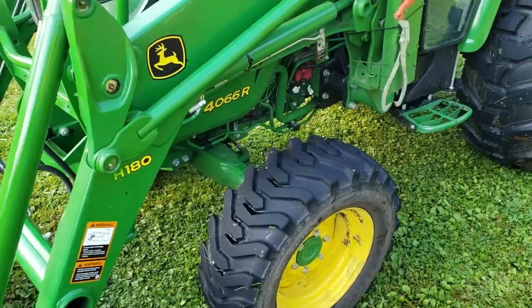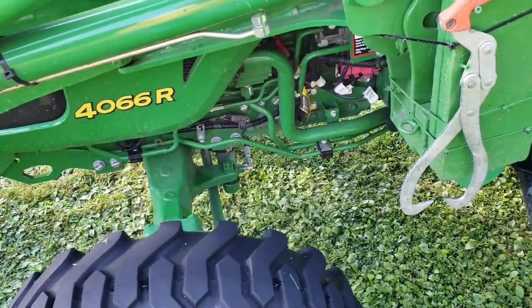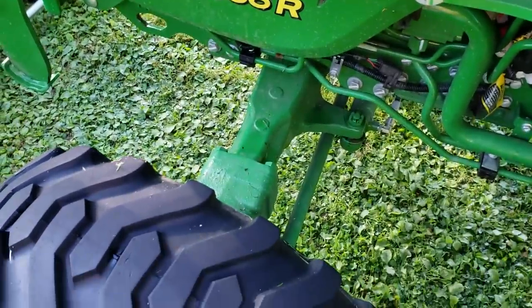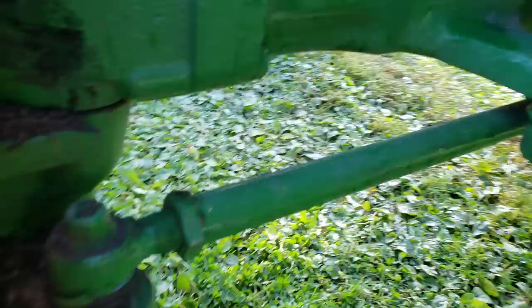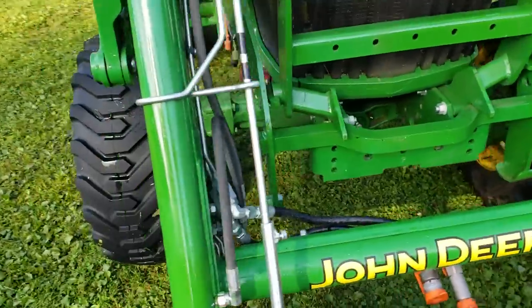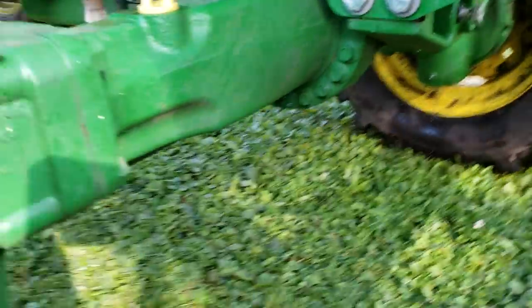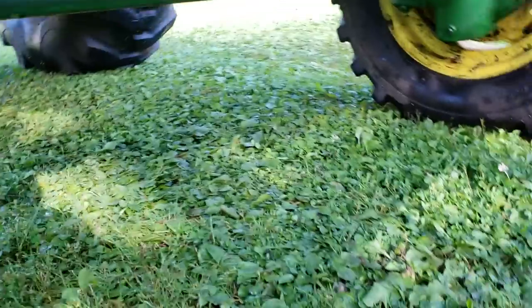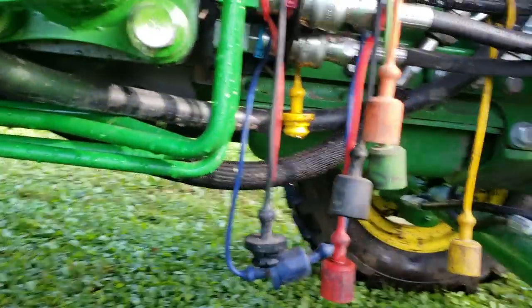The four-wheel drive on this machine works phenomenally. When you're in four-wheel drive and lock the differential — push down that little differential pedal — all four tires spin in my experience, so it's got a lot of push. One thing John Deere sells you on is that the steering system is behind the axle, which is true, but it's well below the axle. As someone who does a lot of logging, that's an issue — I could run over something, not hit the axle, and then hit the steering cylinder. The tie rod is about the same height, so I'd likely hit that first, and the hydraulics are up, which helps.